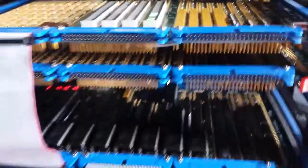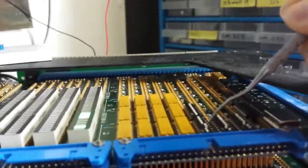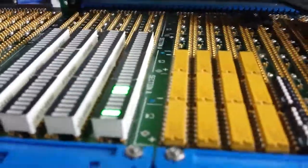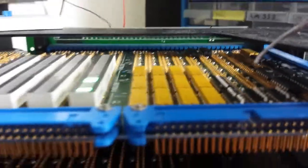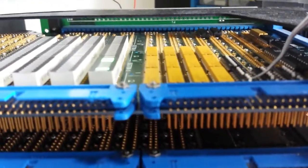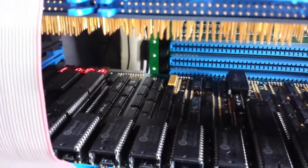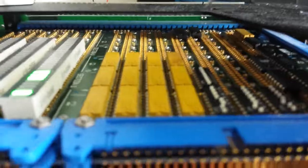For example, the computer is running right now. I can come here to this dip switch and stop the clock — so now the clock stops and the CPU is stopped. I can then flip it again and the CPU just resumes whatever it was doing before.